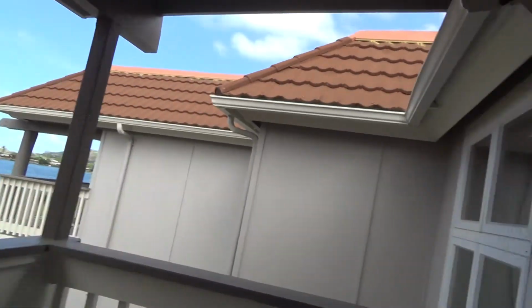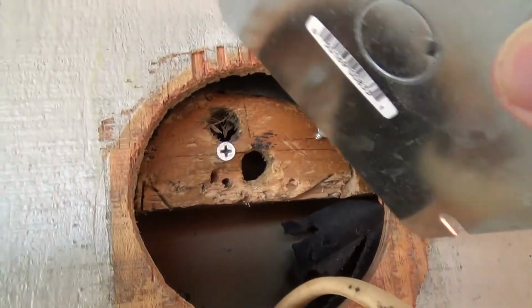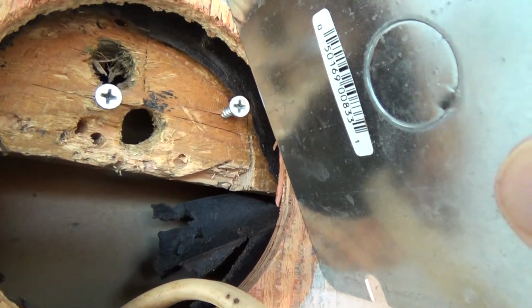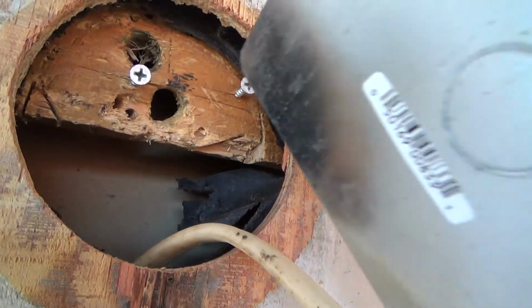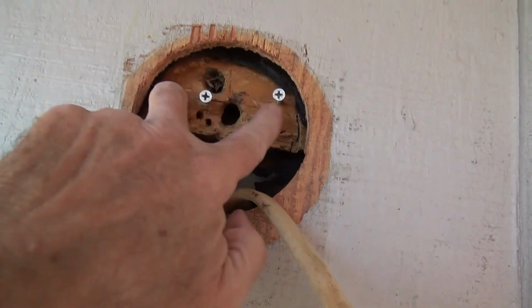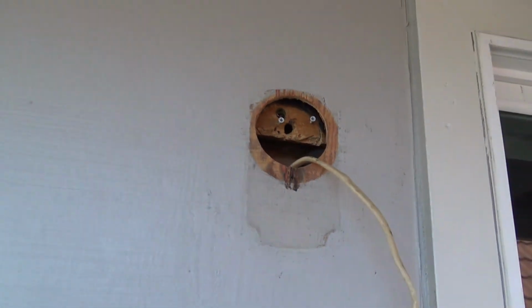And my backing screws that I use, of course, yes. I use galvanized screws too, see, like that. And I just measured the box. It was a little bit less than 1/2 inch, and I just took a plate here. I held that across there, and then I measured the screw from there over, and then if you have to, you eyeball it, and screw this screw in or out, loosen it up, and those are my shims. That's all I'm gonna use, because I was fortunate enough, I cut the box nice and tight in there. And even if it was a little bit sloppy, these screws up here are gonna hold the whole box. And anyways, okay, get ready for my next step.